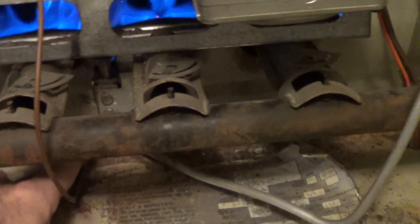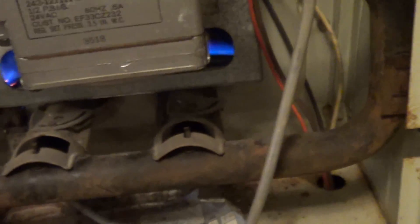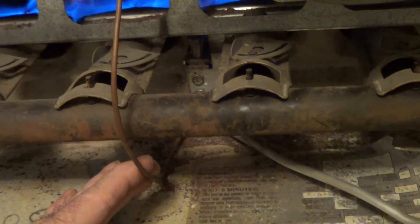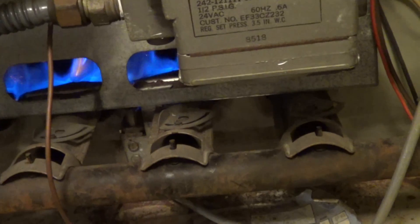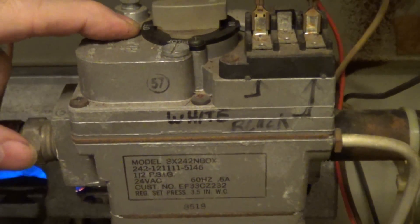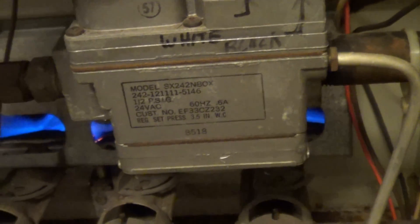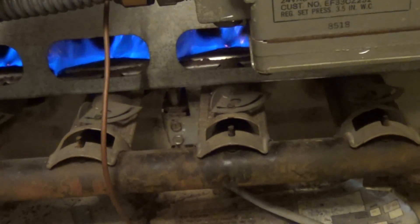The pilot light's over here. This is the gas for the pilot light. This is the sensor. When it starts burning, if you've got no pressure in the thermocouple, it'll shut it off. This is the older type — you've got an on position, off, pilot, on. You turn it to pilot, hold it down for a minute or so after you've lit it, and then the pressure builds up into the thermocouple and it'll keep it open. Then you turn it on.